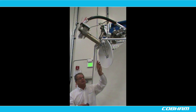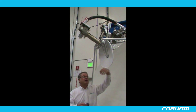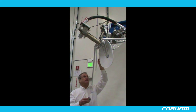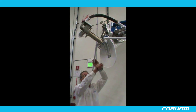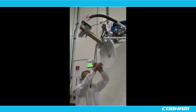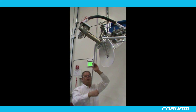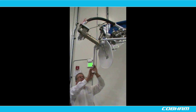One key issue is that this sub-reflector needs to be precisely positioned every time it comes back into position. In the KU band position it has to be precisely aligned, so we have a precision mechanical stop that the motor drives against, with a very fine pitch set screw to adjust it to the right position. To prevent damaging that stop or the gear train motors, we've installed limit switches. As the reflector comes into position it hits the limit switch, and that drops the power to the motor by a factor of four, preserving the integrity of the hard limit stop and the gear train.